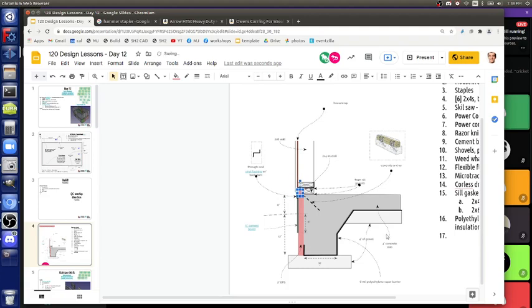Now, another detail: the shallow insulated footer calls for, and this is not shown here, more insulation going out here. So that's what we're going to do. We've got all that insulation that is still out there. If you guys remember, there was the pile of white insulation. Whatever's left over, because we already cut a lot of these slivers for all around the foundation from the existing material out there, we've got about 2.5 feet or so left over, and we're going to do this. That is equivalent to going down, except minus the earthworks.